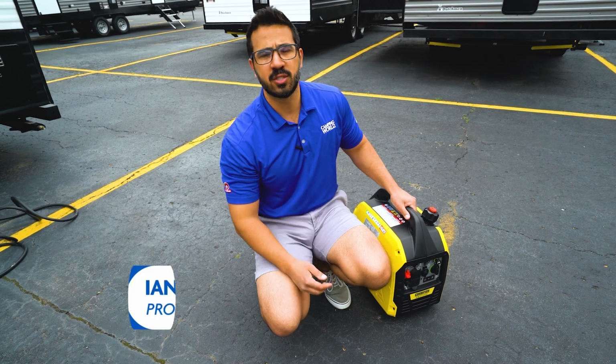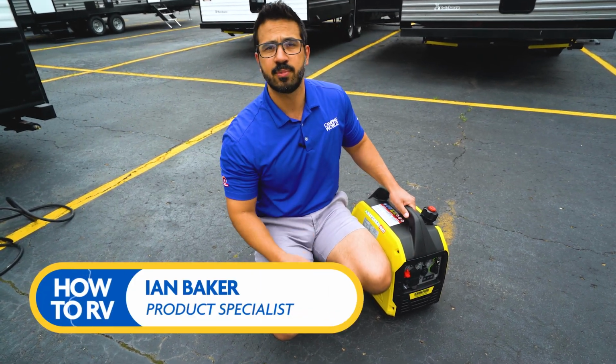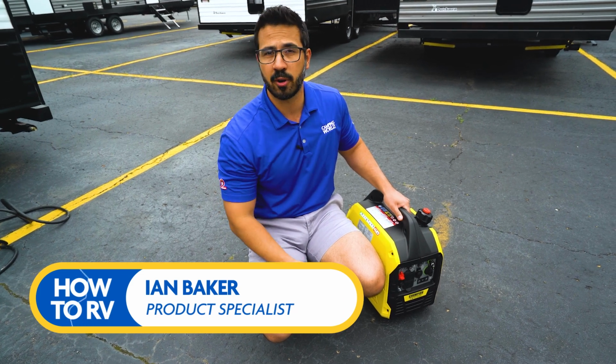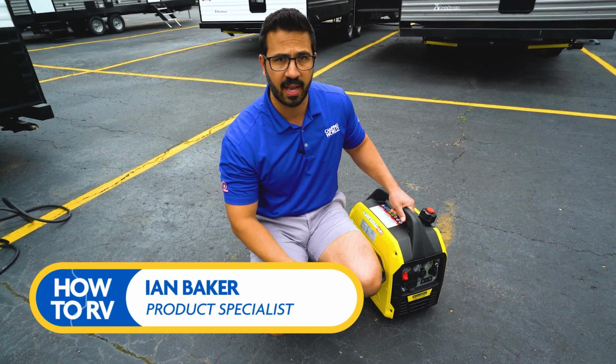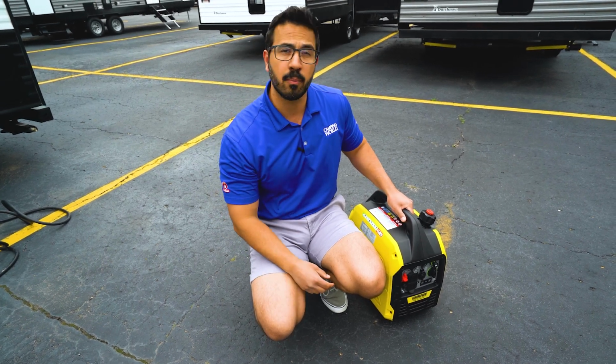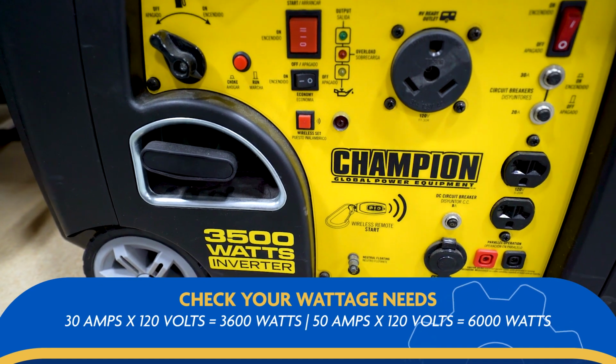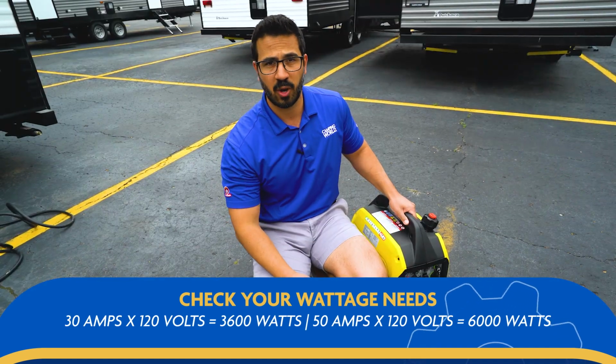All right, let's get into how to properly plug in your generator. One of the first steps is you have to make sure you properly sized your generator, and we do have a video to aid you in that. Real quickly though, just as a baseline, if you have a 30 amp power cord, you'll want at least 3,500 watts. And if you have 50 amp, you'll want at least a 6,000 watt generator.